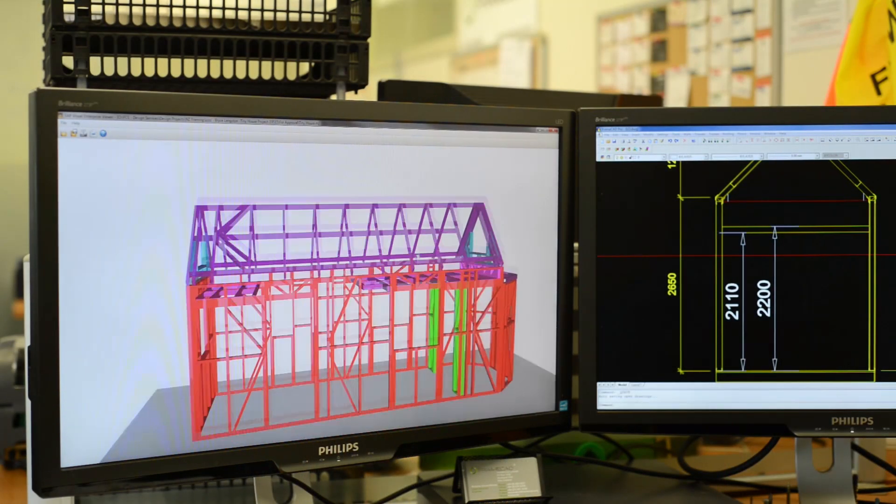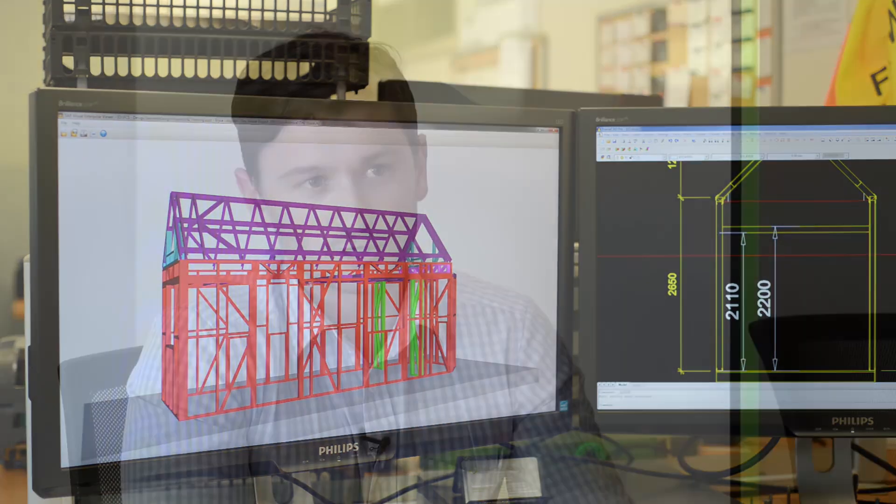The great part about steel framing is everything is CAD based. So we can look at a window, look at a door, alter bits and pieces, make sure you're 100% happy before we send it to the machine to produce. Even if there are changes after we've produced it, it's pretty easy to change. From a timing point of view, once we've actually produced all the framing out of our machine and it's assembled ready to be erected, it's probably going to take around two or three hours — and most of that time is going to be spent just getting the connections right on this tiny house. So it's a very efficient system, with 0.5mm accuracy. Once it's drawn in the CAD system, it'll fit together really easily — like a big boys Meccano set.